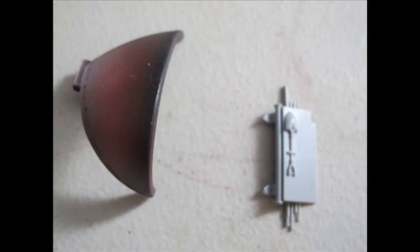Now, just as a bit of a case study, I'm looking at this piece of a Gundam kit and a piece of a military kit. Now, the majority of the piece is about 1mm to 1.2mm thick, out of absolute solid plastic. It does have a bit of flex, though in certain areas it gets a bit thicker as support. Around the edges it's got a lip, and other areas it's just generally thicker, which is injection molding plastic. The military piece on the sides is even thinner, but it's got areas where it actually gets quite significantly thick. This is a structural piece.